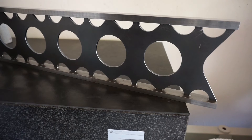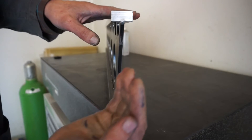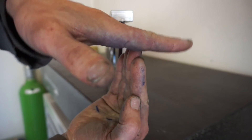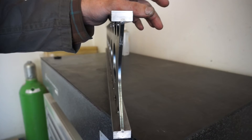At least of equal importance as design is the manufacturing technique. We were talking about the two bottlenecks: being able to scrape carbon steel is the first, and the welding strategy and weld preparation is the second. Making this straight edge does not require a computer-controlled 10-axis high-vacuum laser welding center. Instead, all that's needed is a TIG welder, the right strategy, and a sensitive hand. The welding preparation must ensure that the flanges have a nice surface to sit on the fillet. This means you must get rid of the bevel on the fillet from laser cutting, and the flange should sit on the fillet faces as perpendicular as possible. On this straight edge, I didn't even machine the fillet faces — I just finished them with a file and a right-angled guide block.